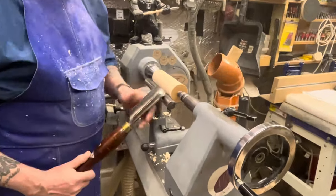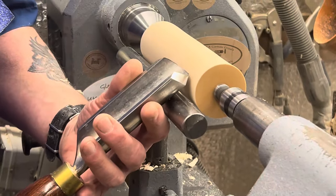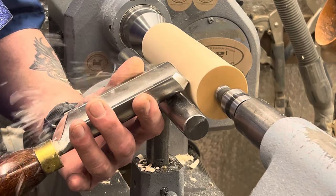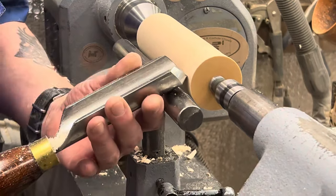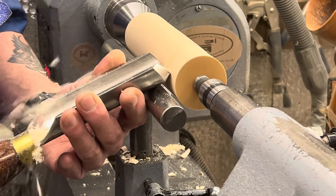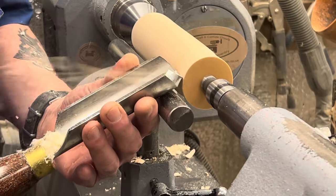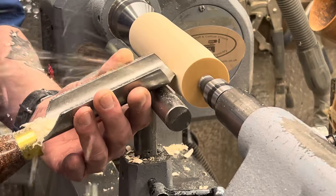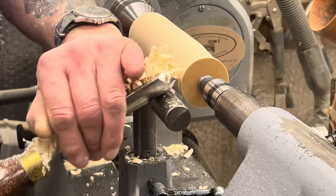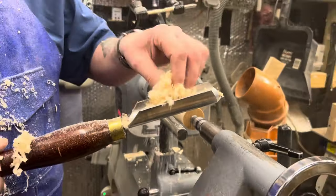So I'm going to show you what I'm talking about. We're on here — I've got my bevel on, okay. Now I've come off and now I have to control how much this tool goes in because the tool will just want to go in and in and in. If I do this going straight in, we get a lot of dust and short stuff, and these sort of curly, twisted, crushed-up shavings.